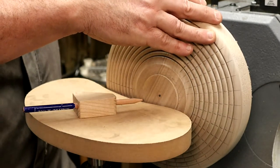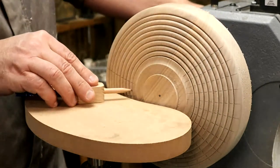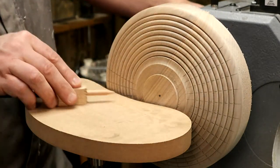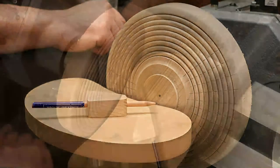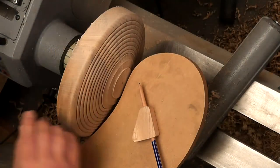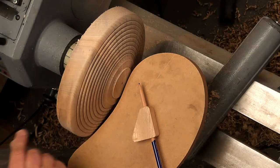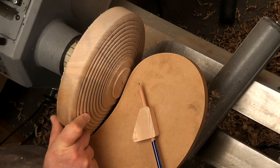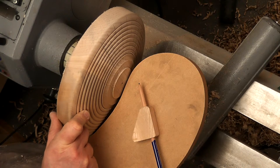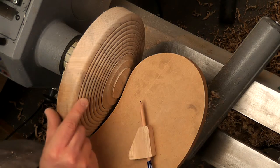And then I've got a couple more here, Colwin. From Jim, what's the point of the masking tape on the spindle with the reference to indexing? That's a little cheat for me, really, because my indexing is back here. I'm focused here, and I've just put some 12 divisions around the outside just to make life a little bit easier for myself and for you guys, so I'm not continuously straining around the back of the piece to find out where the numbers are.